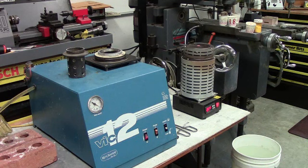And once I verify that, I will take the graphite crucible out of the electric furnace and pour the molten metal into the investment flask. As soon as it's full, I will put the crucible back in the electric furnace so it continues to stay hot, and I will let the poured flask sit on the vacuum unit for just a little bit until the hot button solidifies enough that I can safely take it out of the vacuum chamber and set it over on the bricks to the left.